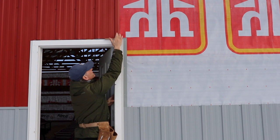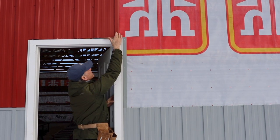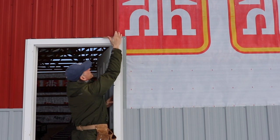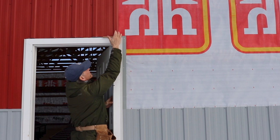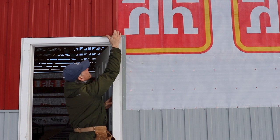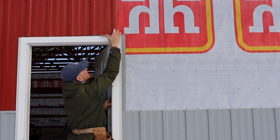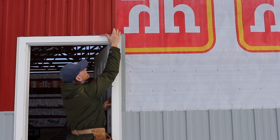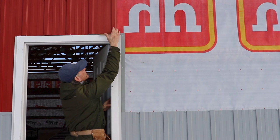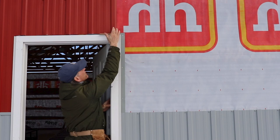And that means that the next red sheet, which will have about a 2-inch cut in it, will come down and meet the gray sheets, and the ribs from the red and the gray will not be aligned. They'll be off alignment by about an inch and a half. So what I need to do is remove the gray sheets to my right that I'm referring to, and trim the first sheet back about an inch and a half, and it'll make up for that variance up top that I'm touching right there.